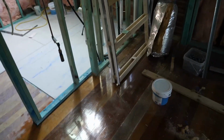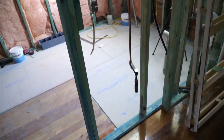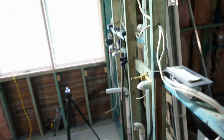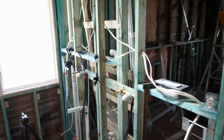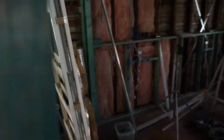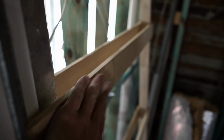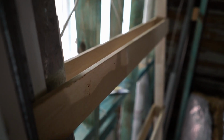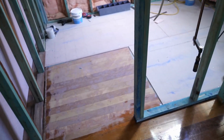That cavity slider will sit inside of that frame, and the reason I've done that is because you really do need a proper surface to fix your fibre cement sheets to. Fixing to the back of this is, you know, some people have done it, but it's absolute garbage. It's only thin pine or ply, so definitely not a surface you want to be fixing any type of sheet or any weight to, and there's guidelines for that as well.